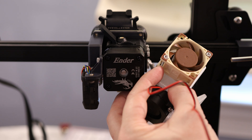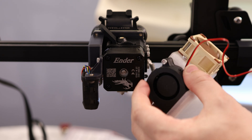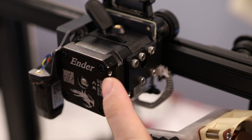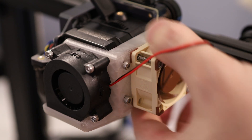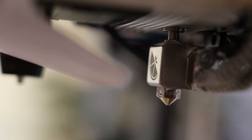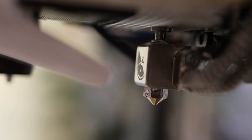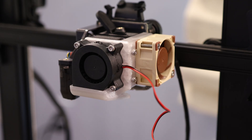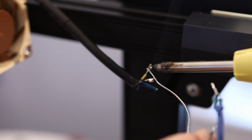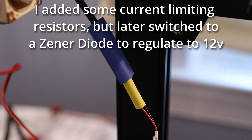This is all put together with M3 bolts and I'll leave a link in the description to a toolkit that has all of these in it. I'm just going to come in from the side and use these two bolt holes. If I loosen this up a little bit, I should be able to slide this up and down. You basically want the cooler lined up so that it's shooting just below the heater block. Now I just need to figure out the wiring. Remember that Noctua follows the ATX standard, so yellow is 12 volts and black is ground. Once you've added enough layers of shrink tube, you can hit it with a torch.